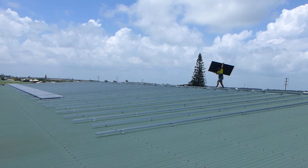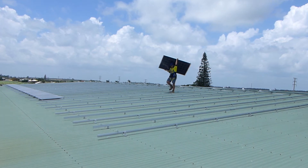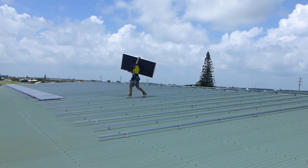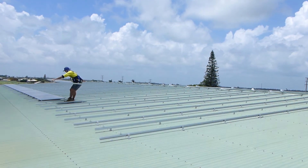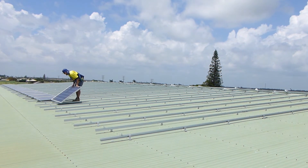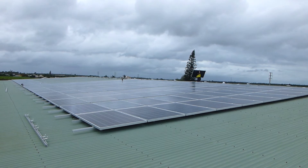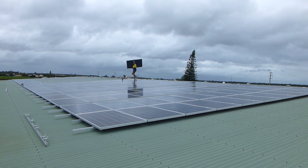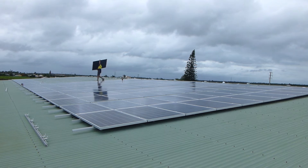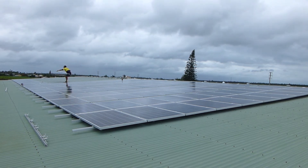Now that the wiring is prepared for the solar panels, we start to install the panels onto the railing system. The panels are carefully laid and positioned along the rail so they can be fixed into place securely and neatly with the railing mid and end clamps. As each panel is placed onto the rail system, the cables from the junction box at the back of the panels are connected in series with the next panel in that row. This is what creates the string of panels. By ensuring the first two rows are neat and tidy, we can then use them as a guide for the remainder of the panels in that array.